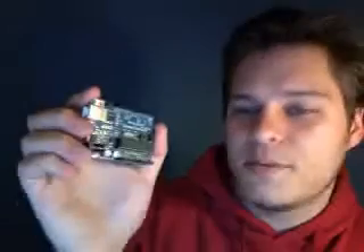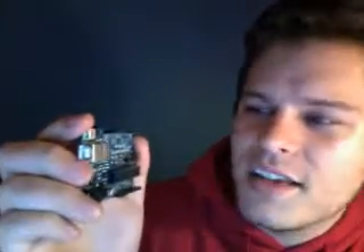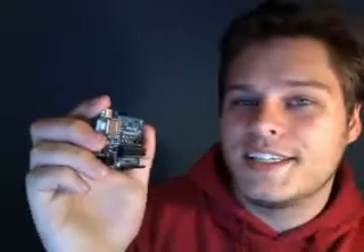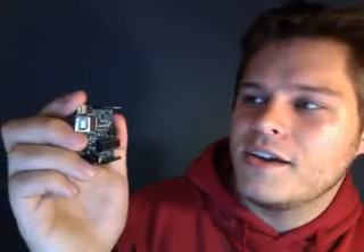This guy has 14 pins, 6 of which have pulse width modulation. Pulse width modulation allows you to essentially simulate analog waveforms — sort of AC waveforms. This is important when you're doing things like controlling a servo, wanting to dim a LED, or anything where you need to vary the output voltage on a pin.